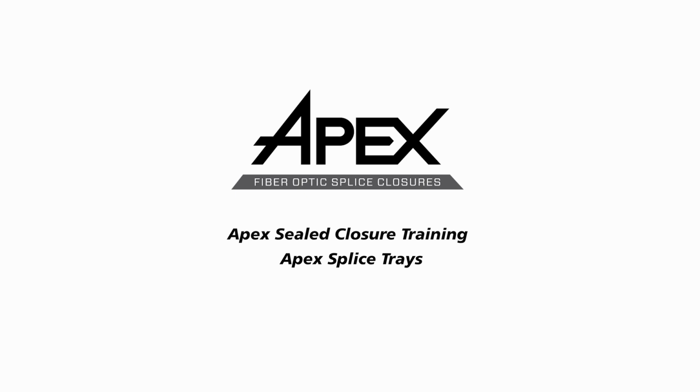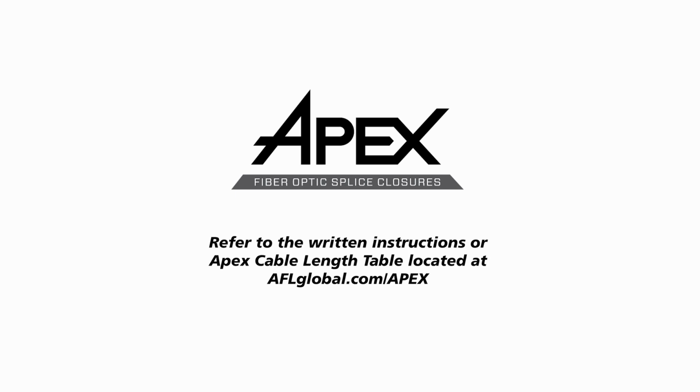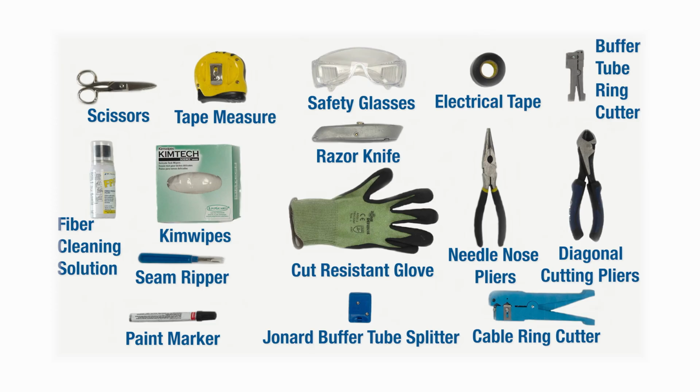This video demonstrates the recommended method to route and secure fiber or tubes in AFL's Apex Splice tray. Cable preparation lengths for Apex vary by cable and application. Refer to the written instructions or Apex cable length table located at aflglobal.com/Apex. The recommended tools for the Apex closure are basic cable tools and a can wrench, plus all locally required safety equipment.